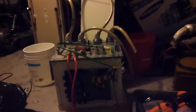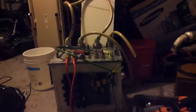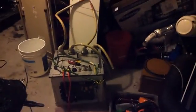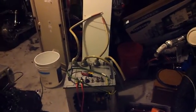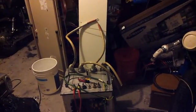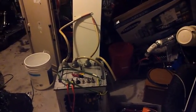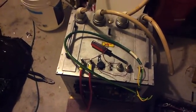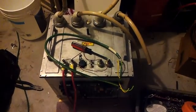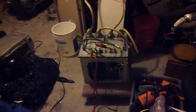Basically inside of this transformer are four smaller flyback-style transformers and a series of diodes. They have a transformer that does the positive side and negative side. It's set up to do two and two to double the current — we have two sets. As you can see coming up into here, I have it wired to both the first and second set to double the current. The wires are kind of thin to the second set only because they're taking about five amps apiece.